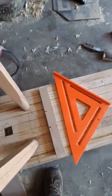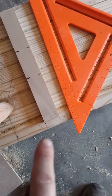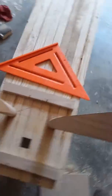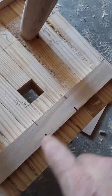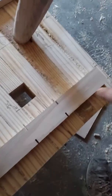I'm going to put one on the other side of the leg. The distance here is 12 inches from the end, 13 and a half. It's a half-inch — one and a half inch wide piece of oak, three-quarter inch thick, so it's going to be nice and strong. The way I've got this notched is I've got a three-eighths inch notch spanning three inches in the center.